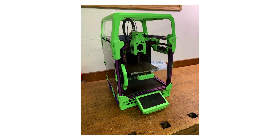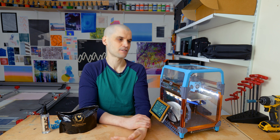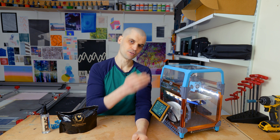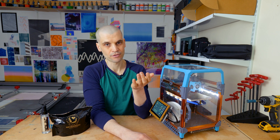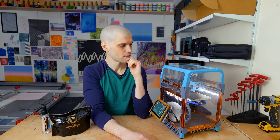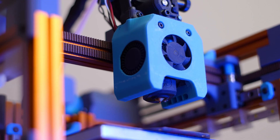As I've been using the Voron more and more, I've changed my initial impressions. I don't think it's actually that well-designed a printer if you need to make any changes to the frame, extruder, toolhead, or anything like that — it's a complete pain. If you 3D print long enough, you're going to experience some sort of clog or jam where you need to access either the extruder or the hot end, and the stock Mini Afterburner is a complete pain to access for maintenance.